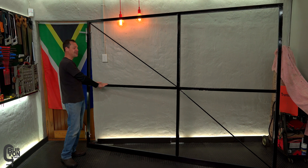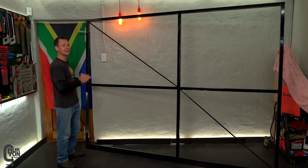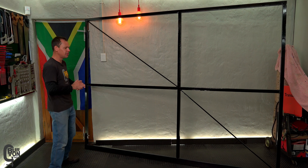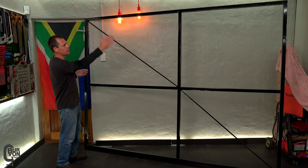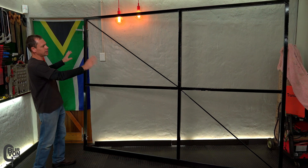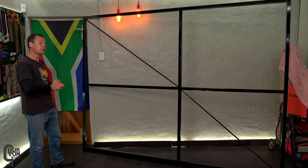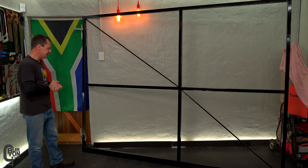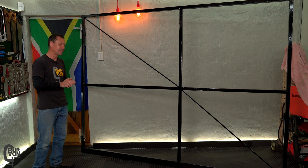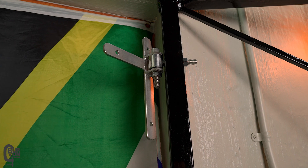Also super stoked because I was able to recycle this gate — it was originally a rolling gate that was probably almost twice as long. I ended up cutting it almost in half, which is kind of why it doesn't look symmetrical. I cut it in half, welded on a new right-hand side and a new top, extended it a little bit higher, and ended up just MIG welding the whole thing together. Pretty happy with the way it's turned out so far. There are another two gates I need to make, but we'll leave those for future videos.